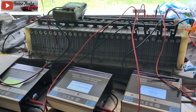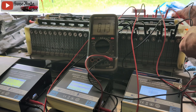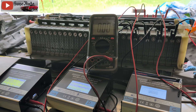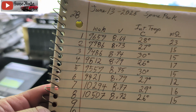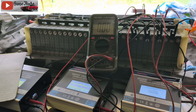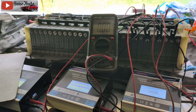All of these are over 9000 mAh, some are over 10,000 mAh, at over 8 volts — and they started at nothing, less than one volt. We still have 8.13 volts. I haven't even cycled them three times. I usually do three cycles, let it rest, then go through the pack and do another three cycles to try to get capacity up to at least a 7 or 8. I'm getting over 9000 mAh on the first cycle, and if I was using voltage alone I would have thrown them away.